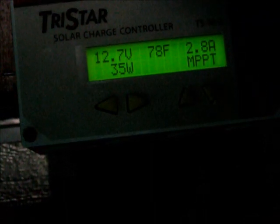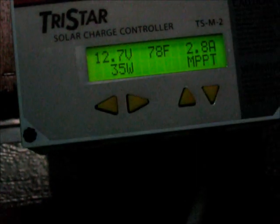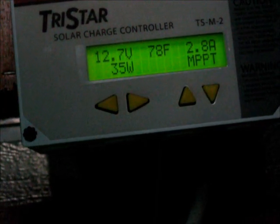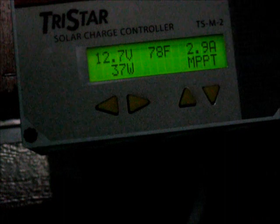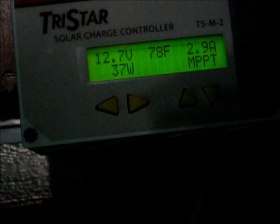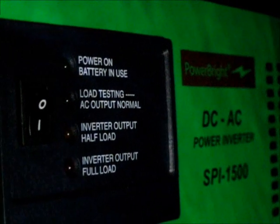There, I've turned on just the fan of the air conditioner and it's running. Now I'm going to try turning on the AC compressor. And I don't know. Oh, I hope that stayed on. That's a bummer. I don't know if that went dark. I don't know if you could see the voltage and what happened. But it's off. The inverter is absolutely, totally off. I don't know what's going on. It's got to be set at a low power battery voltage. I'm going to have to try this experiment again with keeping this light on. Have to figure this out.